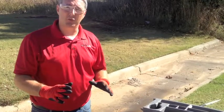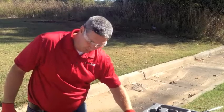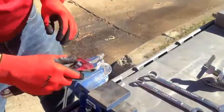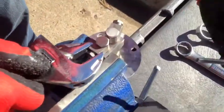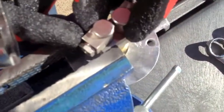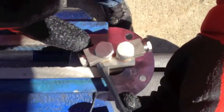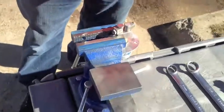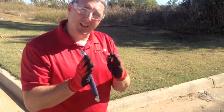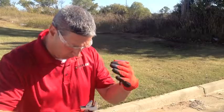We're going to talk about the three-inch head real quick. We just covered setting up what we call the six-inch adjustable speed control head. On the three-inch, a couple of things to note whenever you're setting these up: we talked about coming in off of the corner of the mounting block, swinging our arm to about the point where it lines up right down the plane — that's normally where we'd set it on a six-inch head. What we're finding is because the arms are shorter, you have to set them up just a little bit faster on a three-inch to get it to kick in and roll into motion.